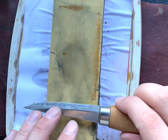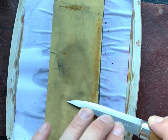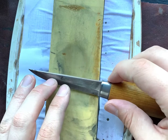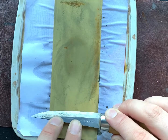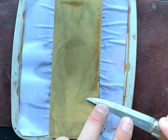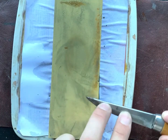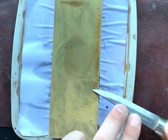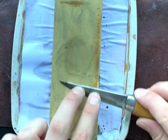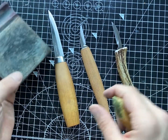This next method sharpens the knife quicker, however it requires more dexterity, because you're moving the knife back and forth, up and down, and also dragging it across the stone. It's more challenging to keep the angle constant, but from my experience this is a better method for sharpening out of the two. I'm not going to show the sharpening process for every single stone because it's exactly the same — it's just the grit that changes, going from a rough stone to a smoother stone, from sharpening to polishing.